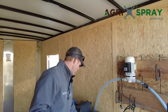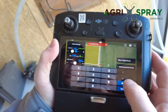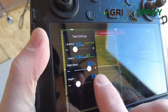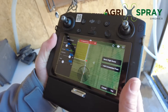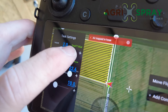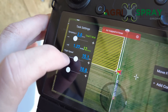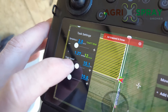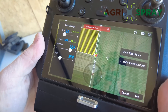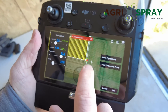Now that we're linked and the drone's booted up, we pull our field up and set our rate. We do most everything at a two-gallon rate. We go full speed — 22.6 feet per second — and we'll fly at 10 feet radar height. With two gallons per acre selected, it tells you this field will require 77.8 gallons total, and we'll run 1.84 gallons per minute at full speed. If you slow the speed down, the gallons per minute changes — this is dynamic flow, meaning the pumps match the proper flow rate to achieve your target application rate.